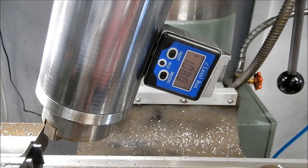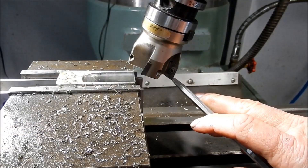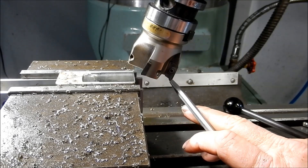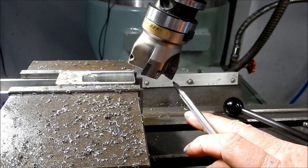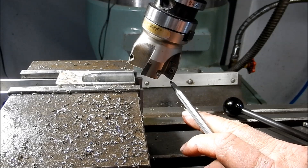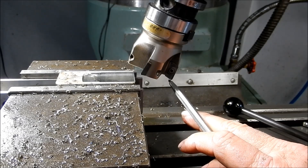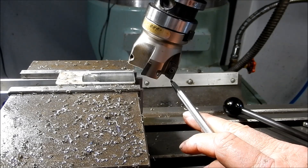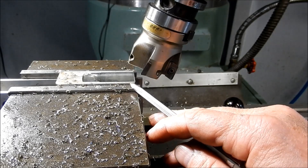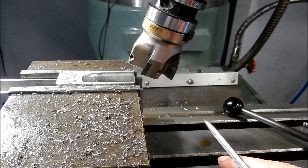We've got our head angled over at 18 degrees - 108 on the level. We'll put the cutter in and show you the geometry we've worked on to create that curve. One thing we need to allow for in the geometry is that although this cutter is 50mm OD, the actual cutting position is going to be inboard from that because of the radius on the cutter tips. Since we're just skimming, I've taken the radius into consideration and taken a millimeter off the diameter. I know what my depth has to be when I'm out to these wings, so we can check that - we should be pretty right with this.